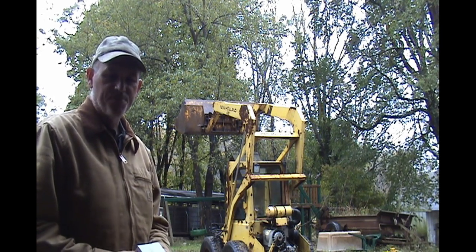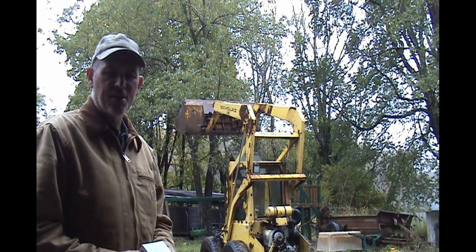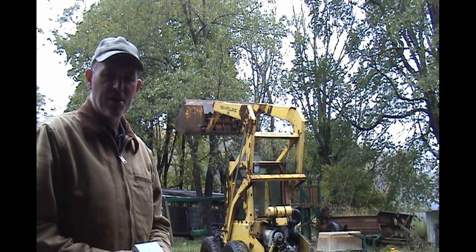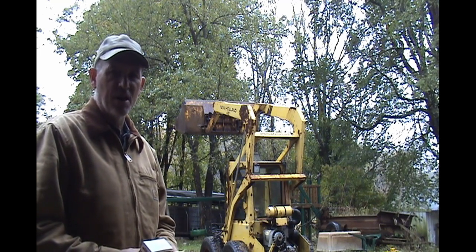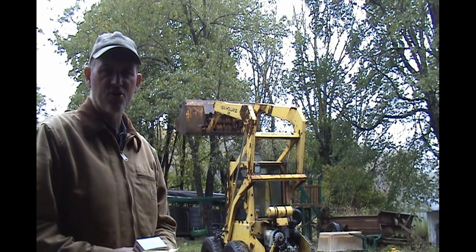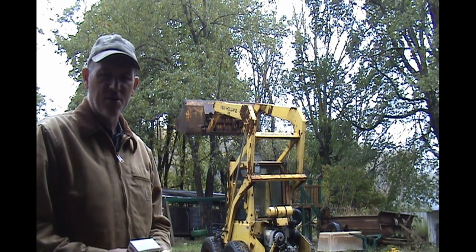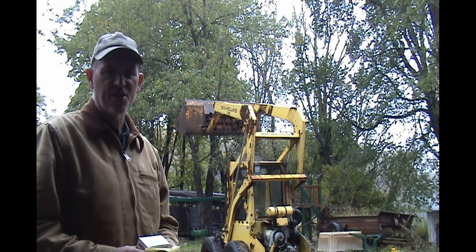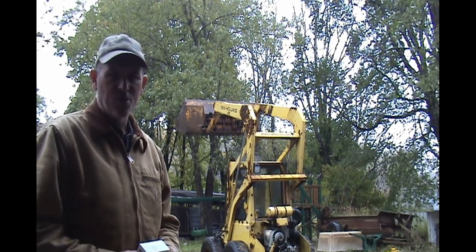Now the book says to pull out the fuel tank, so you can better get at the inside chains and gears. And I looked at that last time and decided not to do that, and just pulled the spline out of the transmission, or out of the case on the side that houses the chain, and was able to, with two people, put it back together without pulling out the fuel tank or draining the oil. And we're going to attempt to do that again today, because if I can avoid taking something apart, I will, usually. So, let's get started.